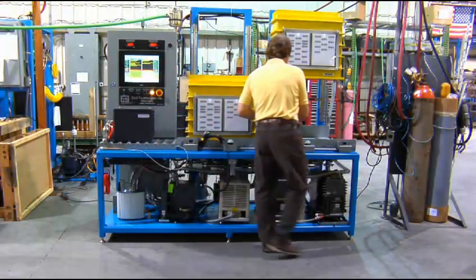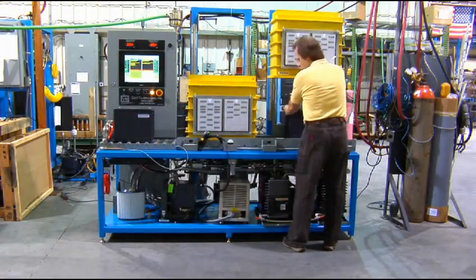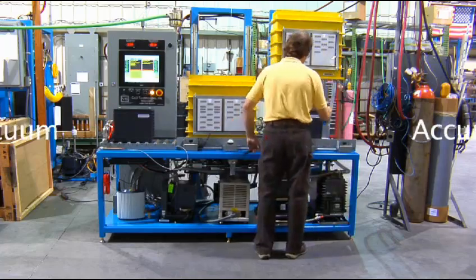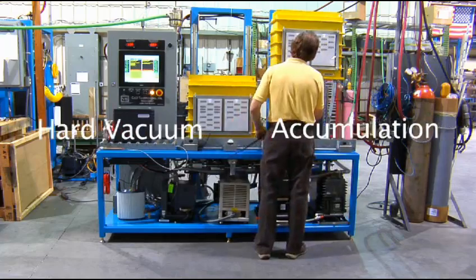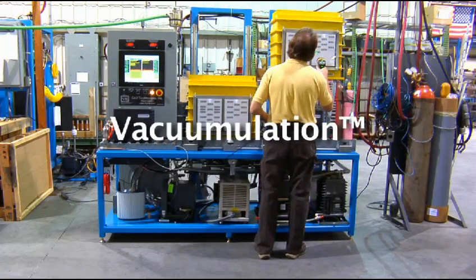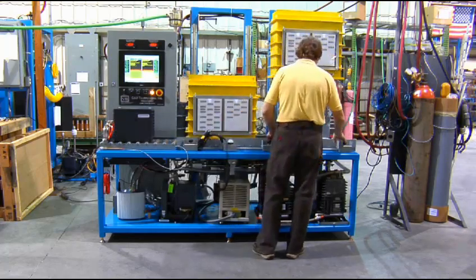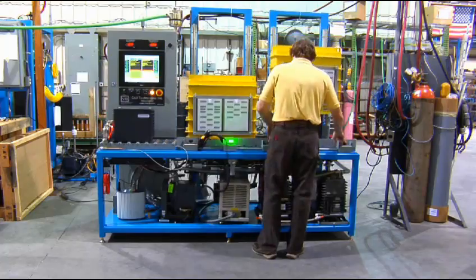This video is the first installment from Vacuum Technology demonstrating our industrial leak test systems in action. This particular system shows VTI's proprietary vacumulation leak test system in operation. VTI's patent-pending vacumulation is a hybrid technique between traditional hard vac mass spectrometer and atmospheric accumulation leak detection methods.